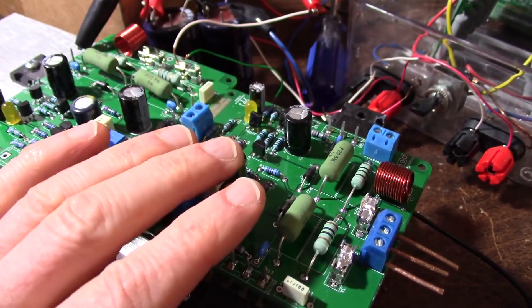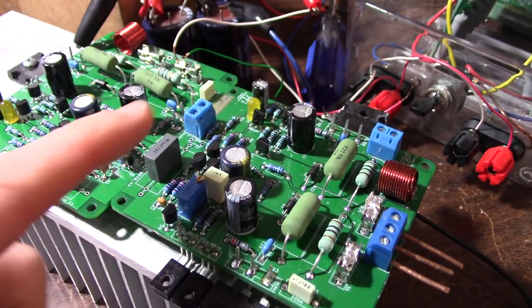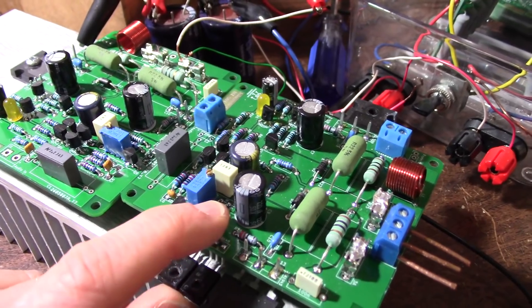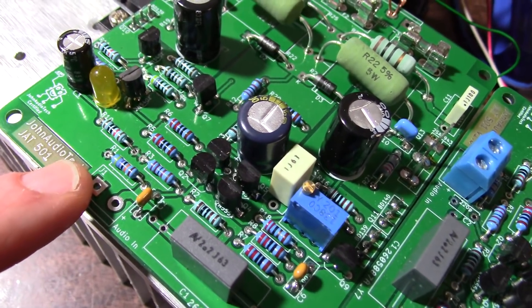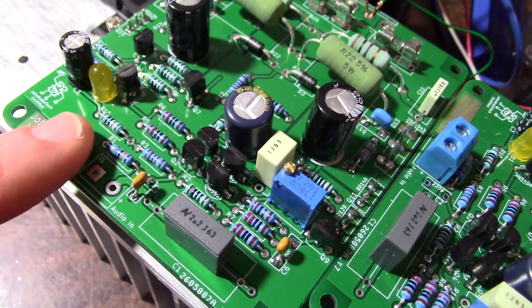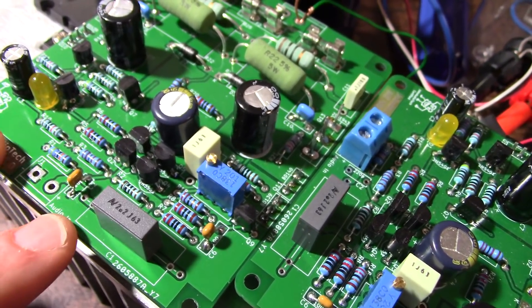In the description I have the Gerber files — make sure you read the readme file first, there's some important information in there. I have a circuit description, a basic explanation of how this amp works and its stages, and also the latest cleaned-up schematic. The boards have all the little part numbers on them, so when you assemble it you just look at the part number and pop the component in. It's very hard to read these blue resistors, so I would check them with a meter — a 1k resistor is not the normal brown-black-red; it's actually brown-black-black-brown because of the extra precision band.